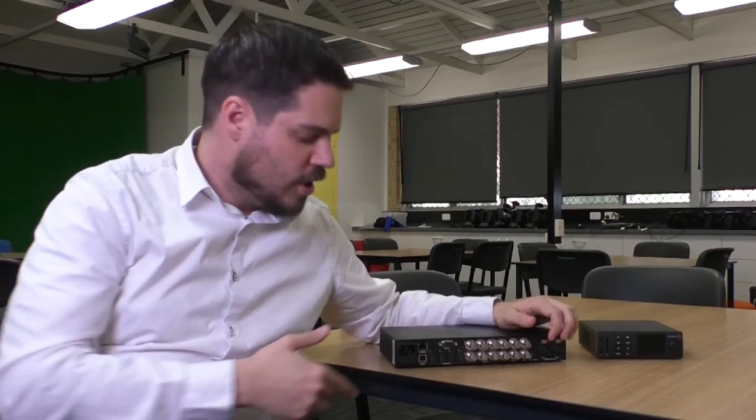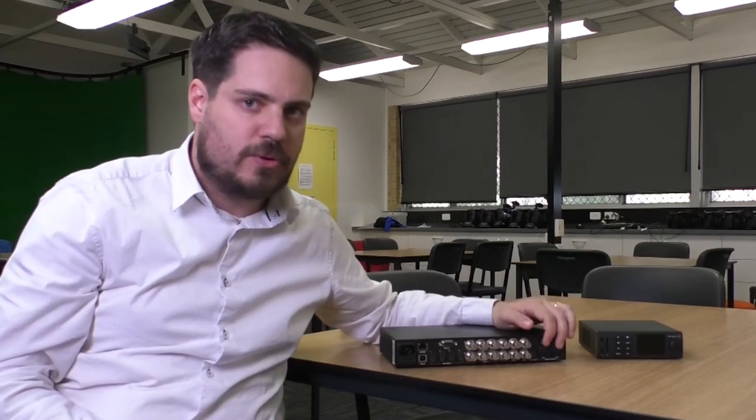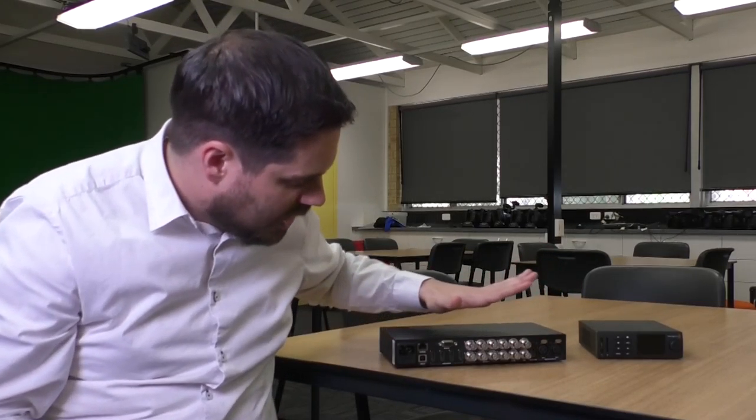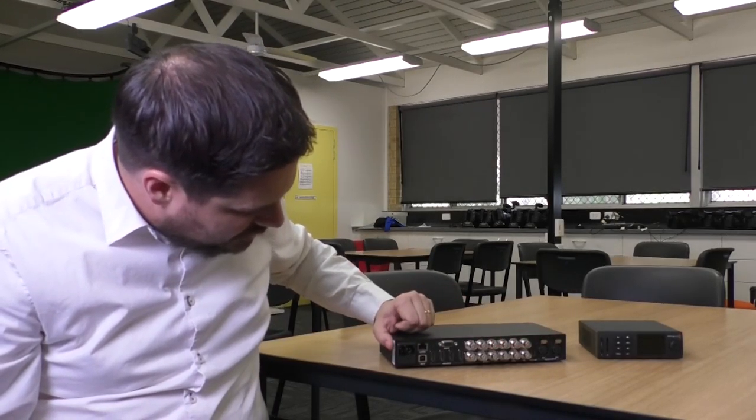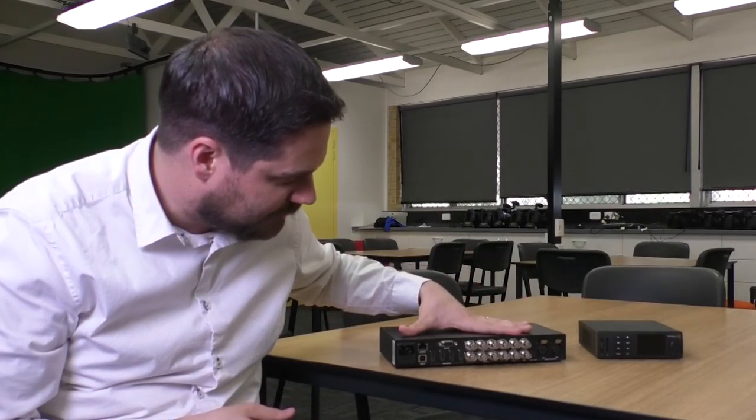As a really basic setup, we're using HDMI and running audio through external microphones connected to the cameras. But you are more than welcome to use the analog audio input for channels one and two to get audio coming directly into the box — whether that be through boom mics or similar. The ethernet port can also connect to a modem or computer system, which is how you gain access to the ATEM software installable on PC or Mac.